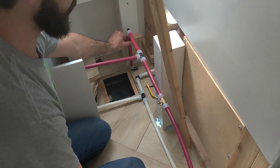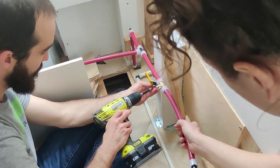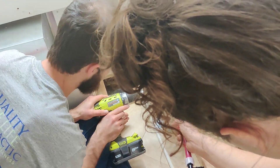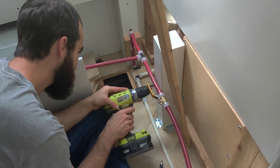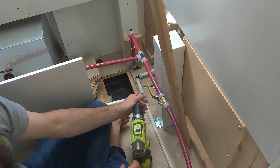We started from scratch with the plumbing in Pauline and we're using Expansion PEX pipe for all of the new plumbing. You can see us here piecing together a run of the hot water line. Once we had put together the pieces of pipe, we then used — I don't know, there's probably a technical term for them — but I call them Lego hands because that's what they look like, which you can screw into the wood and then the pipe just snaps into place.